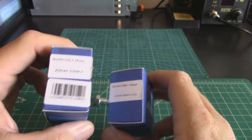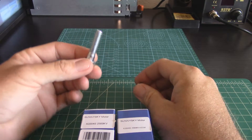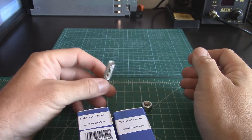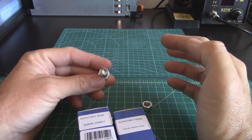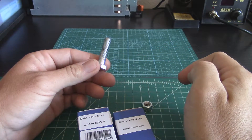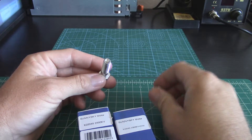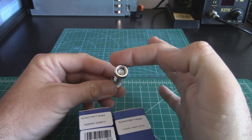Let's look at a nut and bolt as an analogy. The bolt looks like the prop shaft sticking up off the top of the motor. When you look down on that prop shaft from above, clockwise and counterclockwise refers to which direction a nut is going to thread onto the shaft. A typical bolt has a right-handed thread, so it spins clockwise to tighten.